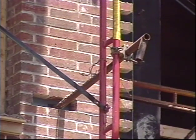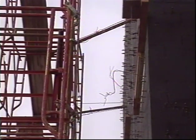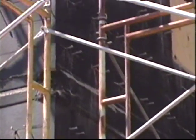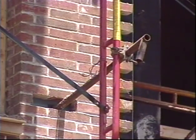Ties need to be braced so they provide resistance in both directions. And the braces themselves need to be secured so they won't fall off if a tie becomes slack. Common braces are pipes and clamps that can be configured to provide a rigid attachment, or number 9 wire twisted tight against a restraint. Some common techniques are attaching to exposed structural members, through openings such as windows, to friction devices such as screw jacks that are set in openings, or to anchors set in the structure itself.